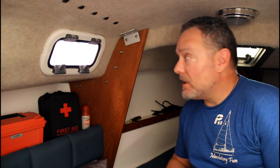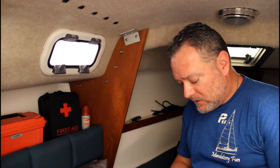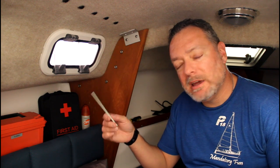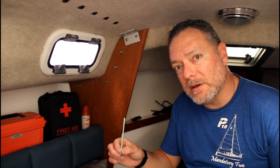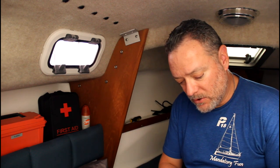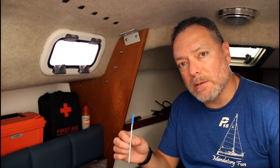What I'm doing here is on the inside of the chain plate holes. There's a backing plate and then another plate that goes on the inside as well, and I want those holes to match up perfectly. A lot of people just say 'epoxy in the holes and drill new holes,' but because I haven't taken the plates out, there's a very definite spot where they need to line up. So what I'm going to do is use these stir straws as a kind of guide — put them in the holes, line them up perfectly, put the epoxy in and let it harden around the straw. The straw becomes the guide for my drill bit. I'm wrapping the ends with masking tape to fill in the hole so the epoxy won't drip out the bottom, then I'll tape them in place and inject the epoxy.